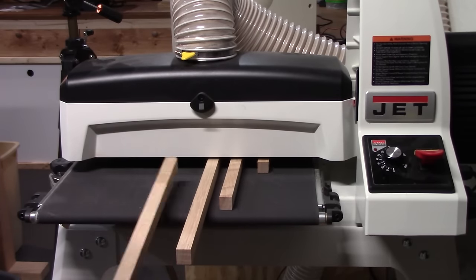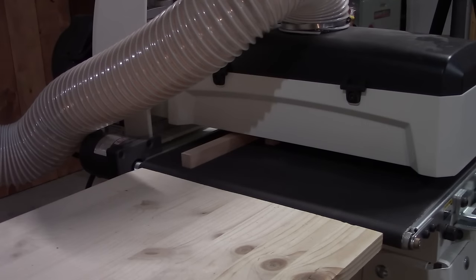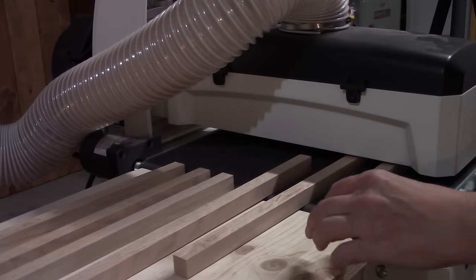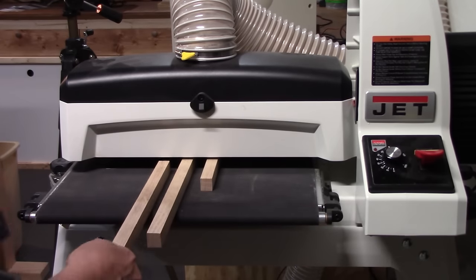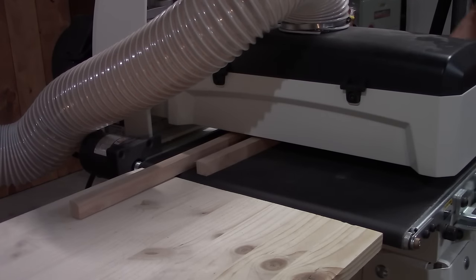After I've got them cut, then I put them through the sander in order to get them completely square. After the pieces of red oak have gone through the sander, I'll rotate each piece 1/4 turn without lowering the drum, and we'll repeat this process until I'm not removing any more material with the drum sander.